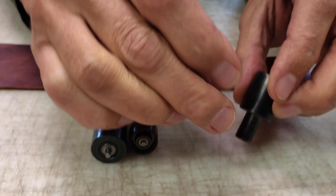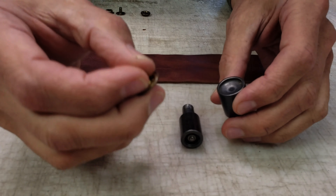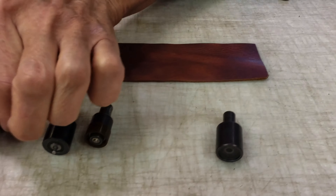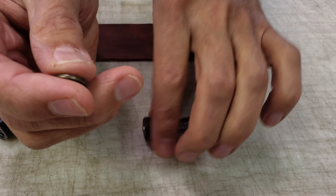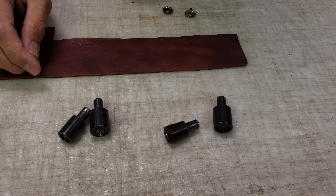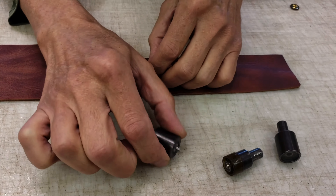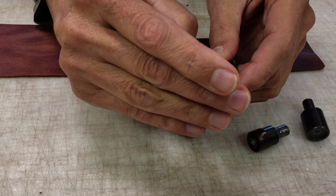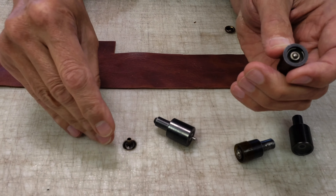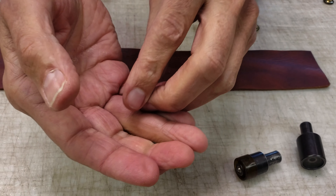To set the Line 24 we use all these tools here — these go in our die setter. We don't use hand tools; we use stuff for our machines. This one is for the button — it fits nicely and tightly right in there. This one is for the socket part, and that goes into the button like that. Then you have the eyelet here — it just sits at the bottom and lines things up. And this stud part fits right in there and stays in there. Those two fit together like this.